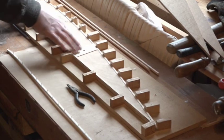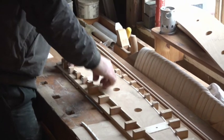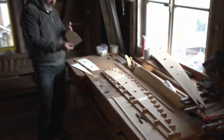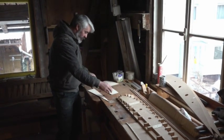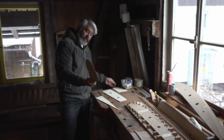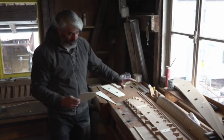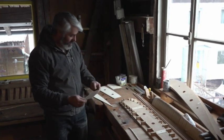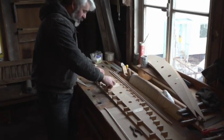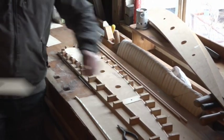The second unwrapped cap strip. And then we have the so-called rib webs, the three pieces. The nose part, the center section, and the tail of the rib. They are made from 1.2 millimeter plywood on the Fokker D.VII. They are done also using the same jig, but we show this in a different step at another time. When the rib cap strips, the unwrapped ones, are in place in the jig, we put the rib webs in their position. These are spacers for the wing spars.